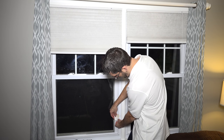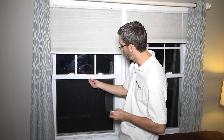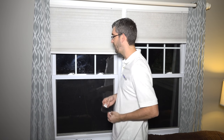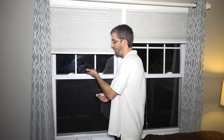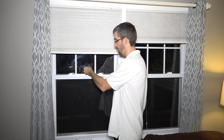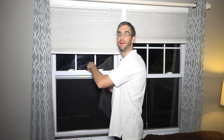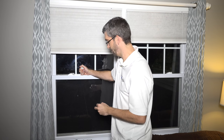If we put the sensor down at the bottom, we would only protect the bottom and would need another one up top. But if we look at the middle — sensor here and magnet here — now we have a way to protect the unit. You have to have enough clearance, enough of a lip on the back window that the magnet won't get knocked when the bottom portion opens up. But because the 5811 has such a small magnet, there really doesn't need to be much clearance — just enough that it's not going to get knocked down. We've tested it and this one's going to work.